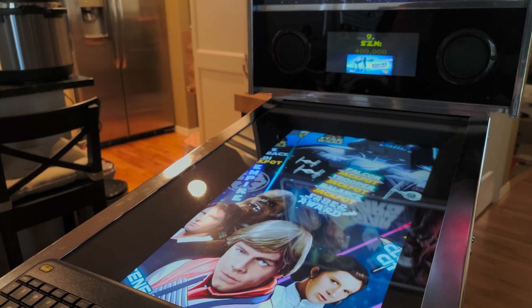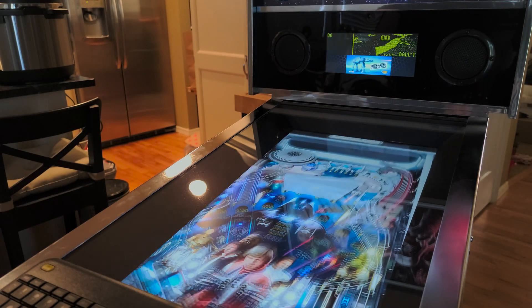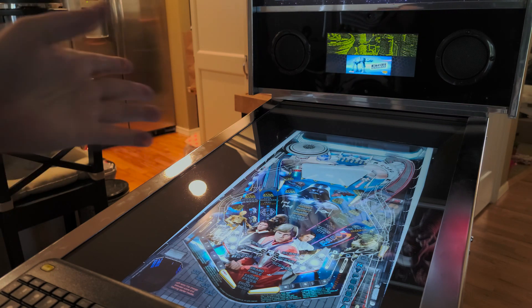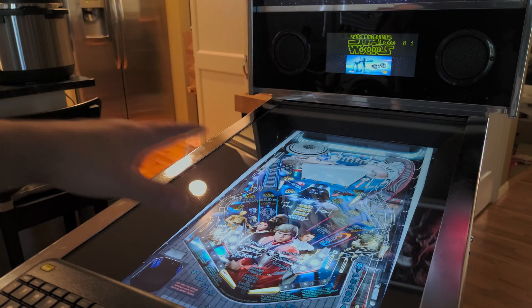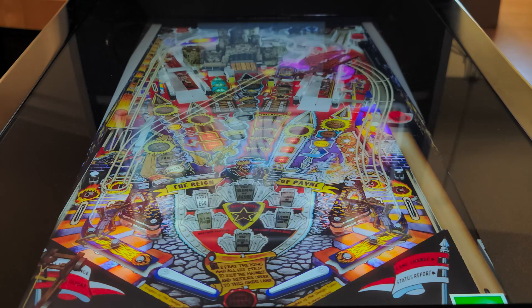A VS Display driver board is what's running the display, connected to my PC. I'm doing that via DVI, believe it or not. The Quadro K620s actually have a DVI and a DisplayPort, so I'm using the DisplayPort for my HDMI out — I can use a dedicated DVI cable for the playfield, and then the DisplayPort slash HDMI goes out to drive my DMD and the audio, as I was explaining earlier.